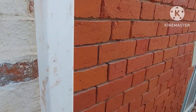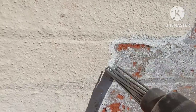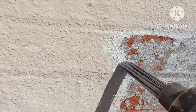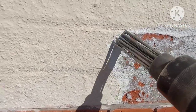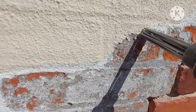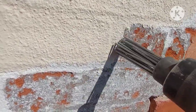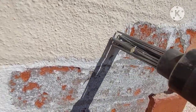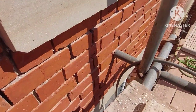Well, there you go — it's just about done. Let's slow it down so you can actually see the needle gun doing its bit. What I tend to do is work away at the edges; it seems to break the paint off a lot easier, going in a circular motion, although very slowly. The little needles jump up and down and they knock the paint off. That's pretty much how it works.